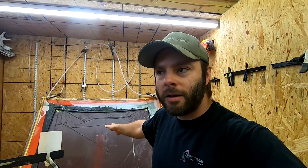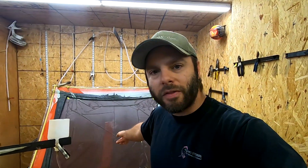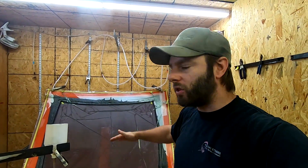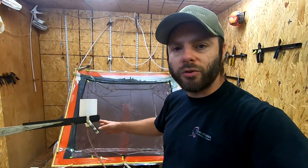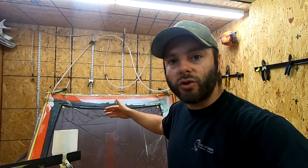If you're curious, I went with an extra slow mix on this one — the hardener was 70% slow, 30% fast. That's because, one, it's such a large part, and two, the spiral wrap on the bottom is new to me. Being a little smaller than what I've used previously, I didn't know if it would slow up the infusion, so I slowed down the hardener a little bit just in case it took too long.